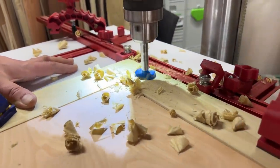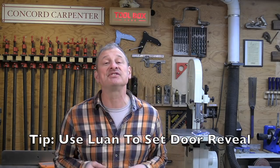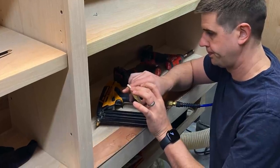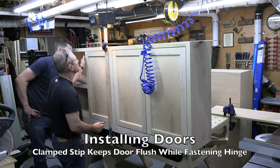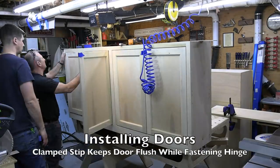After the doors are dry-fitted and padding is done, start installing the hinges and hinge mounts. One tip: I use three-sixteenths-inch Luan as a shim on the bottom — sit the door on it, push it against the frame, set my gap, put my hinge on — that shim provides a perfect bottom reveal. The Blum hinges have excellent side-to-side and in-and-out adjustability with two screw adjustments. If your reveal is too tight, this is the time to shave a little bit off the door on the table saw or track saw to get the reveal you need.